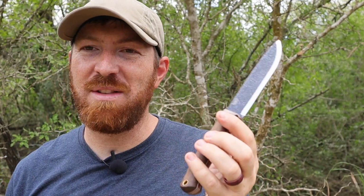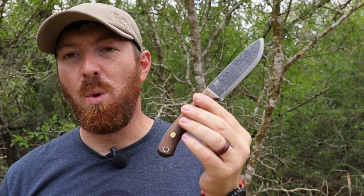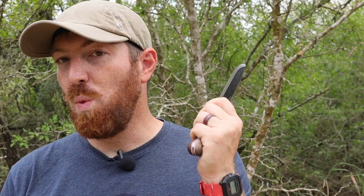Coming at you from South Texas, and I am pumped today for this video because for a long time, I've kind of been on the fence or kind of down on Condor tools, particularly in the smaller size range. I know some of their machetes are pretty epic, but the quality control and steel choices. The 1075 for me has always been a little too soft in their smaller tools. I'm constantly having to resharpen them, with grind angles being all over the place, handle scales being cockeyed or too large or too small, and just weird stuff like that that makes you have to really work on the tool. Well, we're gonna find out if this Bisonte has any of those issues.